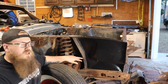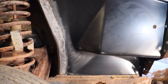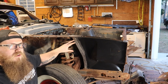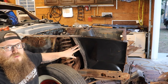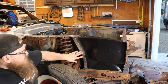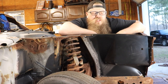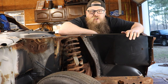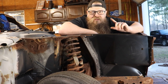After you get all your spot welds finished up, the piece is hammered down in place, fitting nice, and all your welds are done, the last two steps are to grind down your spot welds to what looks nice enough for whatever paint job you're going to do. I grind mine down with 36-grit, then use an orbital sander at 80-grit, then an orbital sander at 220-grit — that gets rid of all the scratches so I can paint it later and it won't look terrible. That completes this part of the Mustang repair. We have a lot more sheet metal to go through, so if you'd like to see more videos, please like and subscribe. If you have any questions, shoot them down in the comment section — thank you for watching.